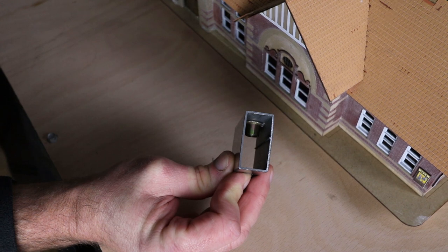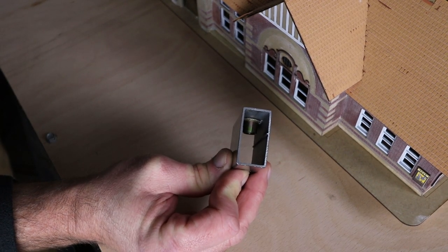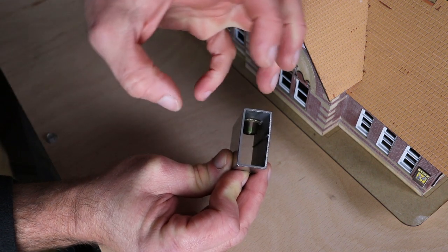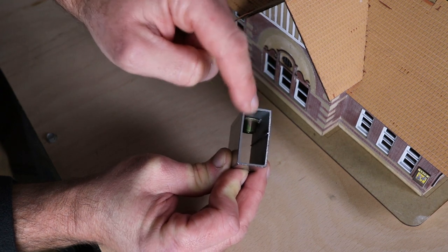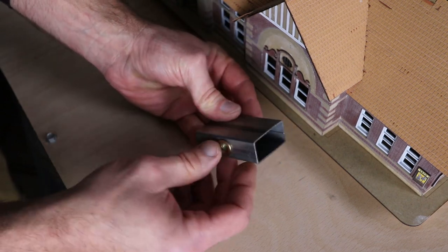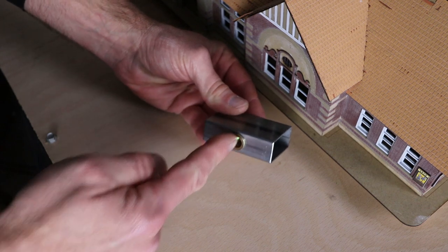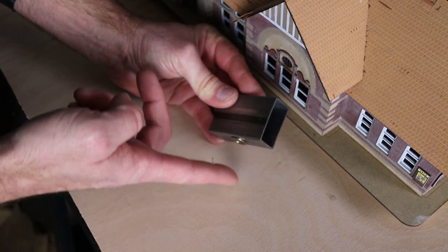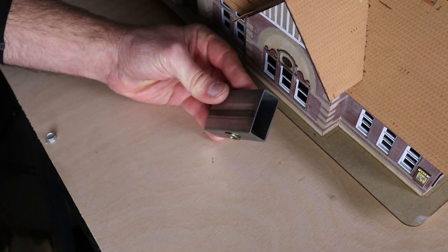Very basically, that process of riveting the riv nut, or squeezing the riv nut, has caused the riv nut to deform and kind of form itself around the inside profile of the tube. And as there's a flange on the outside, that's now permanently fixed, and we could put a bolt or whatever we like into there. And so that's how I'm using bolts to connect this to my uni-strut base frame.